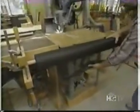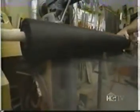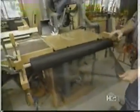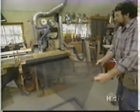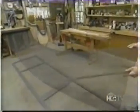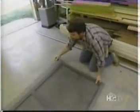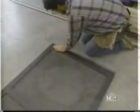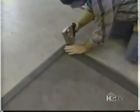You notice I need to have 2 frames at a time to do this. Now the screen fabric is fiberglass, and I found that it's less expensive to buy a 100-foot roll rather than the individual pieces. I really only need about 60 feet, but I'll have some spare around should I need to make a repair. I roll it out to the end of the frame and square it up, roll it over the edge, and attach it with a few temporary staples.